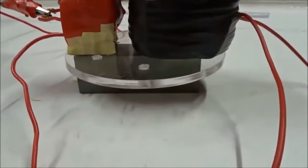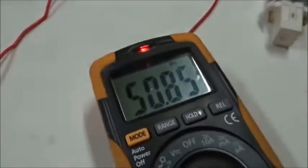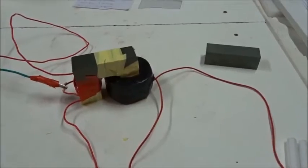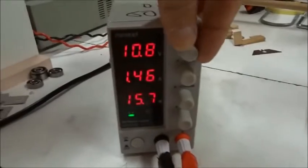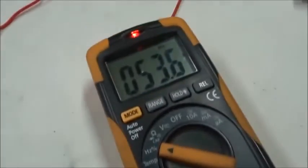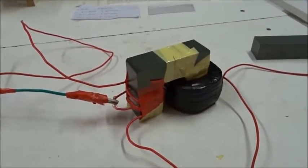If we put a five millimeter sheet of perspex between the U-shaped coil and the bar, at the same 20 volts one amp, we see 50 kilohertz and get some lighting, but maybe not quite as strong. When we separate the lower iron bar from the U-shape completely and go again to 20 volts, with three plus three turns and a one microfarad capacitor, we see 53 kilohertz but can hardly see any transformer power — it's very weak, with almost no light from the bulb. At 25 volts and 30 volts we can just see a tiny bit.